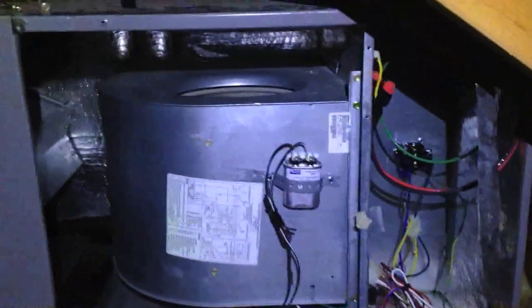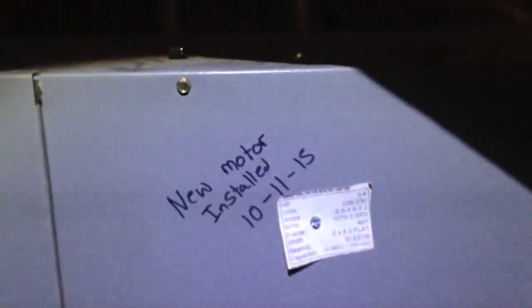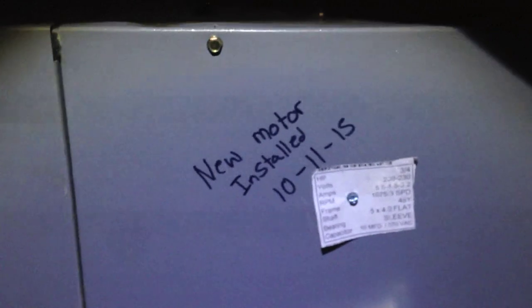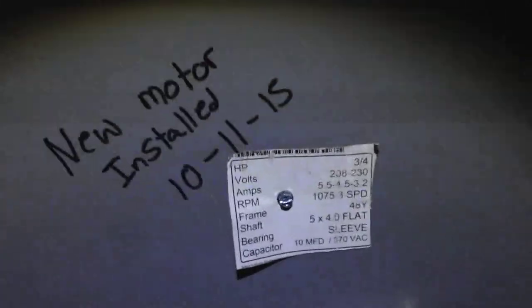She's all buttoned up, the amperage and the cap looked great. A little note for the next guy up here: we installed this new motor today and I left the spec sheet for the motor on the box, screwed it to the unit — just cut it off the box. That way they know what they're dealing with, because I hate when I get to a retrofitted motor and don't know what the amperage is and have to pull the motor housing out just to see what it's rated for. We've gotten into a habit of doing that anyway. Grab my trash and we're heading out.